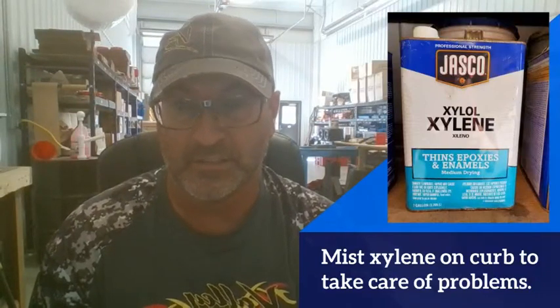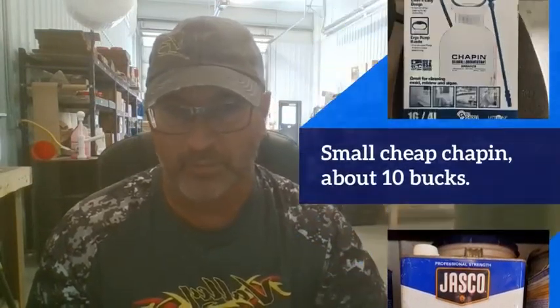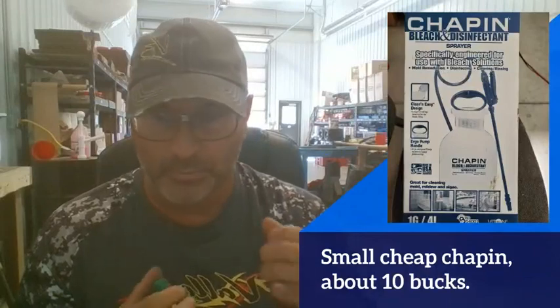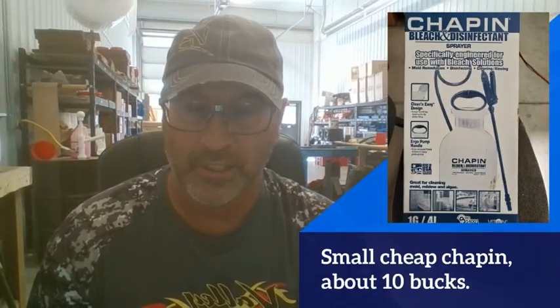You're going to take xylene, and this is the solvent that is typically already in the sealer. Okay, you'll take xylene like this, and what we need to do is reemulsify that sealer. So if the sealer's been there for a month, 2 years, 5 years, it really doesn't matter. As long as it's a solvent-based sealer, you can take xylene and mist it over the top. Okay, we're not there to put a bunch of this on and scrub, because you're taking off the sealer now.